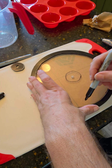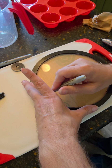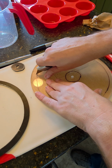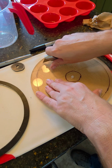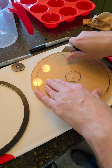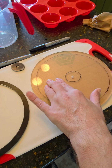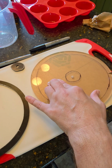Now when I set this up before with the other one, I used UV cure resin, and the UV resin did not penetrate well through the acrylic, so I had an issue with it bonding and curing because of that. So this time I'm using one that'll take about 8 hours to cure to the point where it's able to be moved. And then by tomorrow, when it's time to change over the vibratory tumbler, I'll be able to use the new lid with the phase 3 grit.